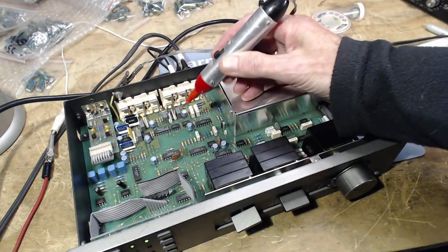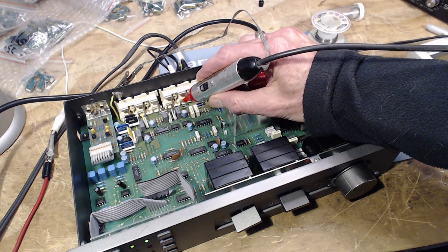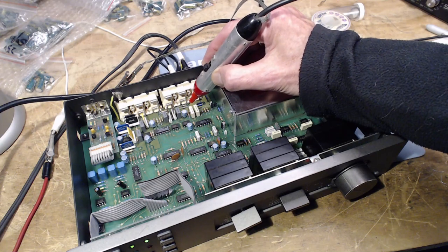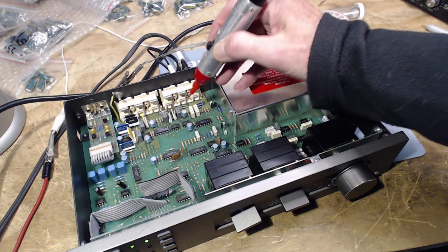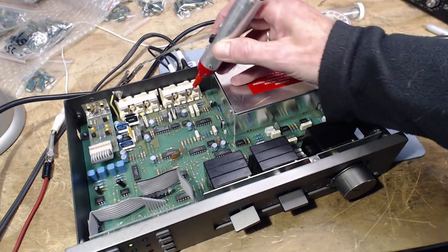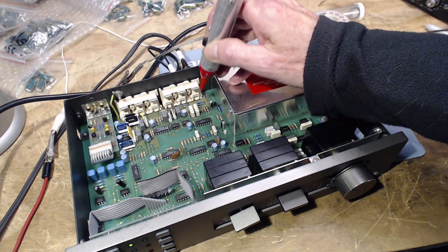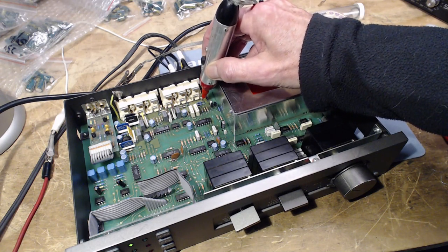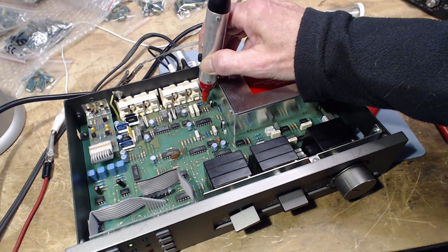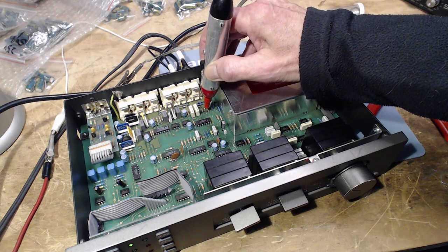I should be seeing the same component side by side, one channel or the other channel, and I just work my way through - not knowing really exactly what I'm doing, but I'll show you what I found. Starting right at the inputs here. Two channels coming in. I should turn this off mono - it shouldn't make any difference. One over here, one over here - there's the two channels. There's two identical resistors here.